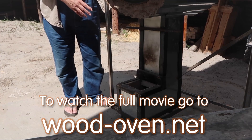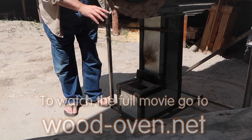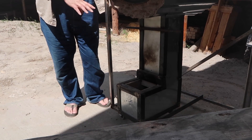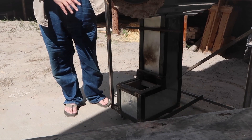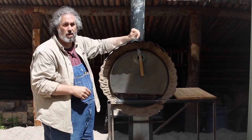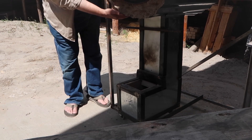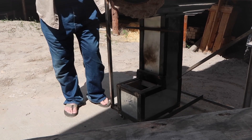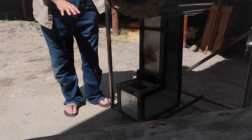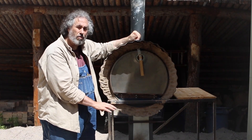Here is our J-tube. The J-tube is not as tall as we would like it to be. But if we made it taller to keep it portable, the oven would be moved up way too high — inconveniently high. Because the riser is shorter, the wood feed has to be shorter. The wood feed can be no taller than one-third the height of the riser.